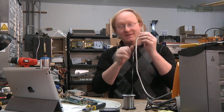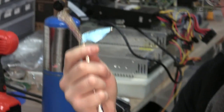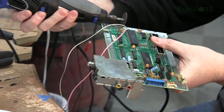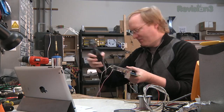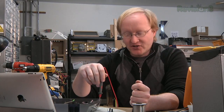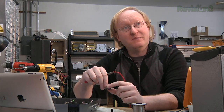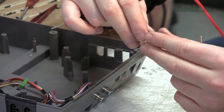This is actually an Xbox 360 video cable, and they're kind of useless now, but I keep them around because you can get nice shielded cables out of them, which I can use on things like this Nintendo. We can add a pair of RCA jacks back here for the left and right audio; video we can keep the same. I'm going to add the left and right audio jacks — they'll come out here on the side — and I'll also have potentiometers because most tutorials online suggest mixing in a little bit of the mono sound so it isn't completely separated. I'll put these potentiometers on the side so I can do that manually after the fact.